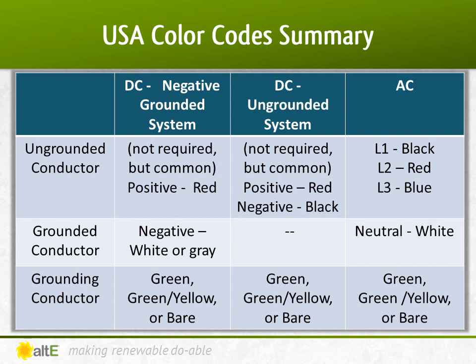It can be difficult to find wire larger than 4 gauge with insulation color other than black. So it is acceptable in NEC to mark the wire with UL-listed electrical tape or paint. It is also allowed for the sunlight-resistant PV source wires coming off the array to have the grounded conductor marked with white electrical tape or paint at all ends, as that wire is usually only available in black.